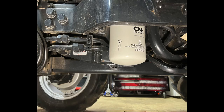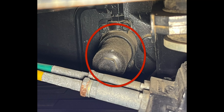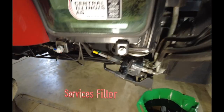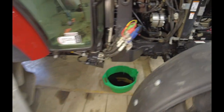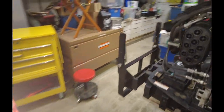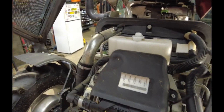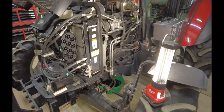Now another filter — if you look down below here, that's going to be your hydraulic and transmission filter. That's another filter you're going to want to do at 300 hours. And there's a cartridge filter underneath over here — that is also a 300-hour filter. That's the other hydraulic filter you're going to need to change. After you do your engine oil filters, you're going to top off your engine oil. Your hydraulic oil filters, you're going to top off your hydraulic oil and check that dipstick. And your coolant top-off is going to be this coolant expansion tank. So there's your main filters for the Case 75C.